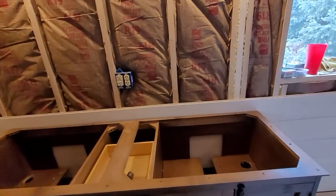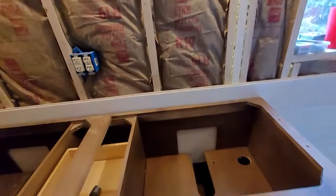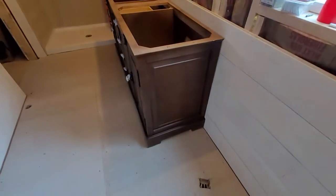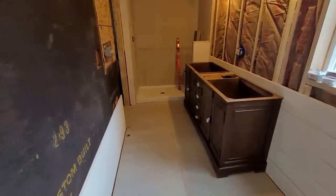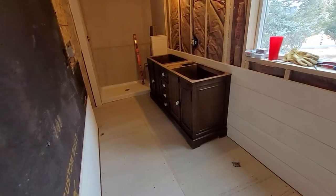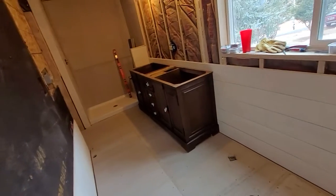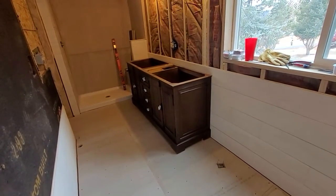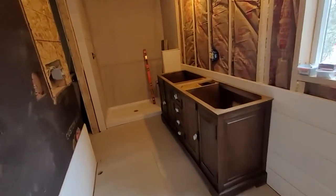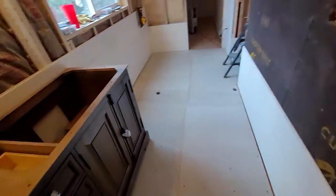Down below doesn't matter as much. It's more or less where you put your screws in here to mount the vanity. And yeah, the floor or something's off. I don't know if there's levelers on this. I'm not sure. But I'm just trying to do some dry fitting before the tile goes down. It's a lot easier. I mean, thank God I got the unit in here. And like I said, it's just a lot easier to do stuff beforehand, not after. Getting layout, get the holes drilled. I'm making all my messes now before the actual tile's down and grout.